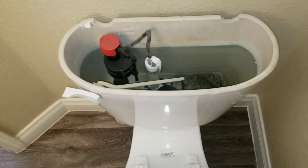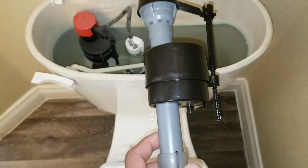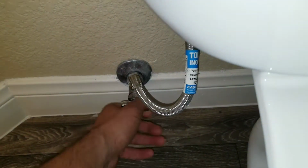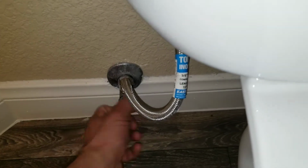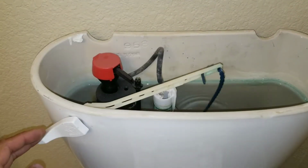On today's video, I'll be showing you how to replace your Fluidmaster 400A series fill valve. Turn off your angle stop to your supply line for your toilet. Flush the toilet.